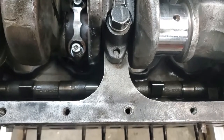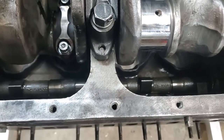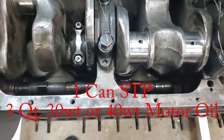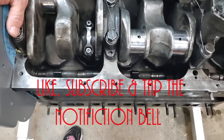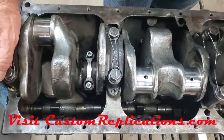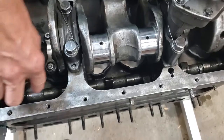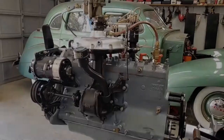Not only for the main bearings and the camshaft, but for everything in the engine requiring oil, here's what we use for engine assembly lube: one can of STP oil additive and three quarts of either straight 30-weight or straight 40-weight standard oil — not 10W-30, straight 30-weight; not 10W-40, straight 40-weight. Always be sure to use that on every moving surface as you're assembling it. When you do your camshaft installation, don't forget to lube all your lobes and make sure they're all lubed when you put it in.